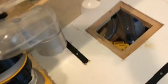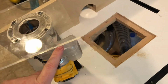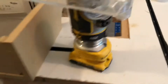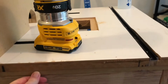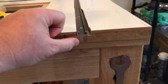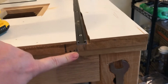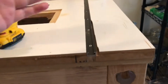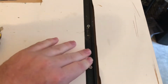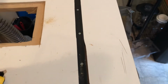To help with dust collection. But the problem is that this section right here of the dust collection fit underneath this section here because I got way too much wood. Because remember, I've got 3/4 inch, 1/4 inch, and then this little white piece of MDF. And as you can see, the tracks, when I put it in, how much it cut down, that's why I said I overbuilt the table. I didn't need this piece of MDF, but I already glued all of this together, so I'm SOL. When I used the router to cut the T-track, to insert the T-track, well, I screwed all that up too, and I made lines and stuff like that, but for the most part it's straight.